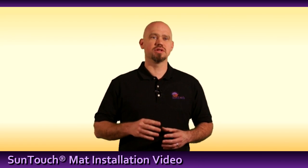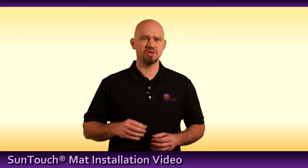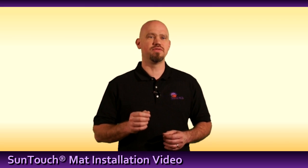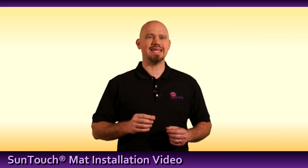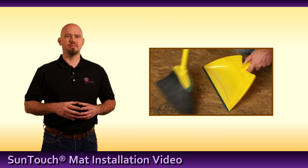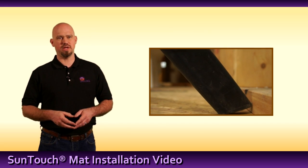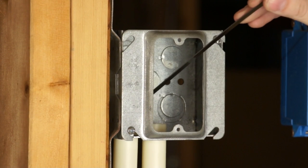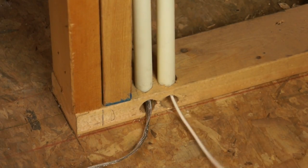Mat can be installed on frame floors or slabs. No matter the application, always install mats before installing mortar or cement. Do not lay mat in wet mortar. Before installing the TapeMat, be sure to thoroughly clean the floor, removing all debris. Begin installing the mat by feeding the power leads up to the control location. Do the same with the sensor.